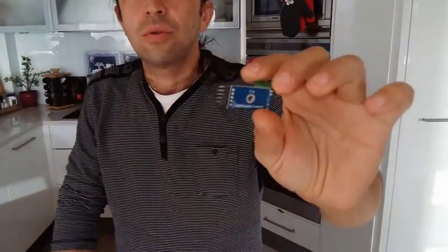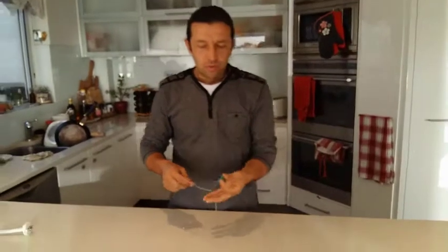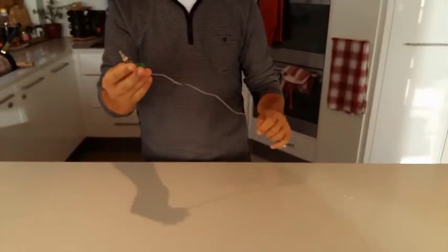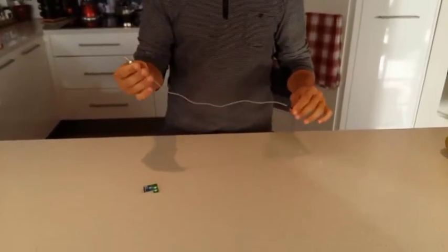Now that you have all your components set up, it's time to connect the thermocouple. You would connect the thermocouple not directly but through a board that converts the input voltage from the thermocouple to a digital value for your Arduino. For example, this is a MAX6675 board — it will convert anything up to 1024 degrees Celsius, which is pretty good. Usually it comes with a thermocouple, and these are typically rated to 500 or 800 degrees Celsius. Sometimes they're advertised as 1300 — I bought two and burned them at about 900 degrees and they broke, so be careful of that.